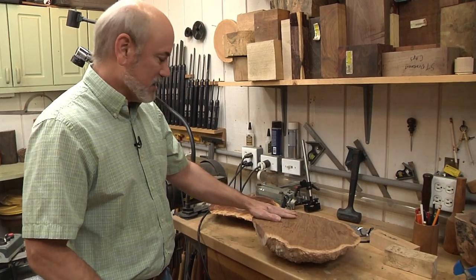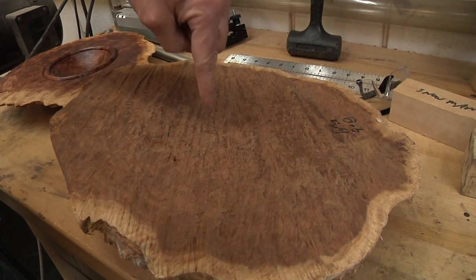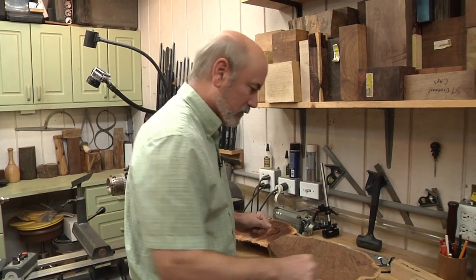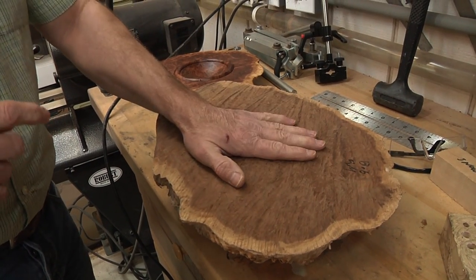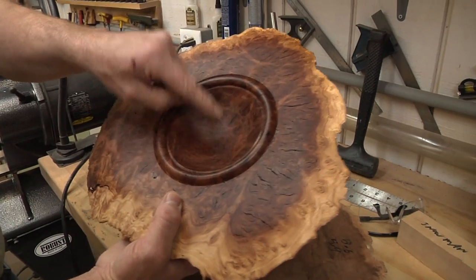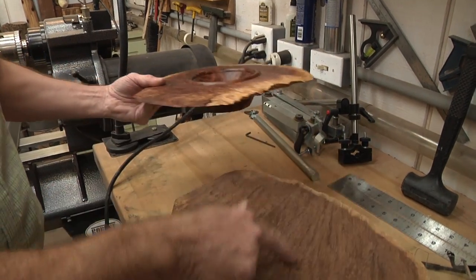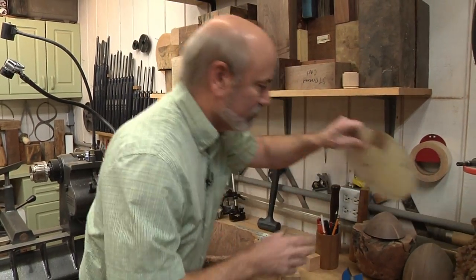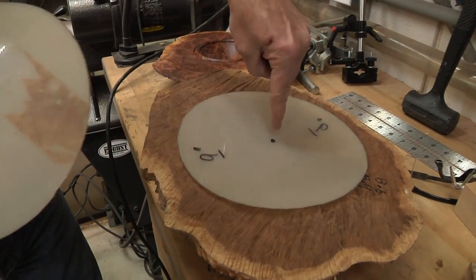Whoever is doing the chainsaw work on these is an artist — it's really nicely done, but it is still bumpy. I want to drill a hole here and have this suck up to the jaws of the chuck, but I need this surface to be perfectly flat. If it's wobbly I might not get a good hold. I need to drill with a Forstner bit a clearance right there. But where do I put this hole? There's so much weight out here that I can only turn at about 100 RPM for quite a while because it's so out of round. I want to try to get this one more balanced so it'll circle right.